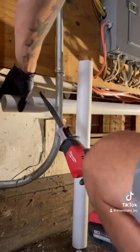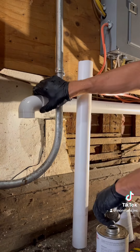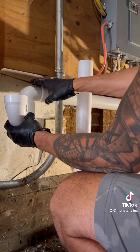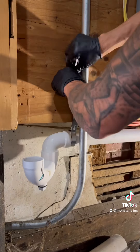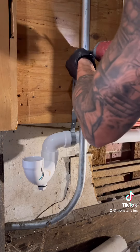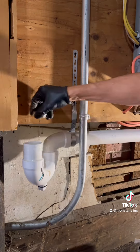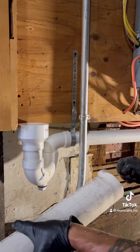We're going to set a two-inch trap. Some of you are going to say that's longer than six feet from the vent — it's under six feet by a couple of inches. Then I'm going to put a two-by-three-inch reducing coupling on the riser so I can create a three-inch cup standpipe to run the condensate lines over and down without worrying about them falling out.